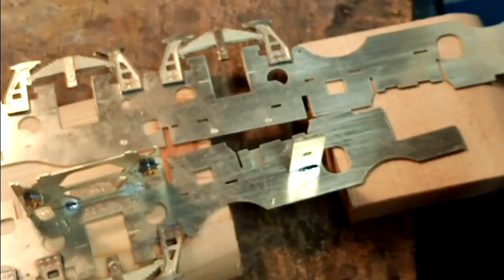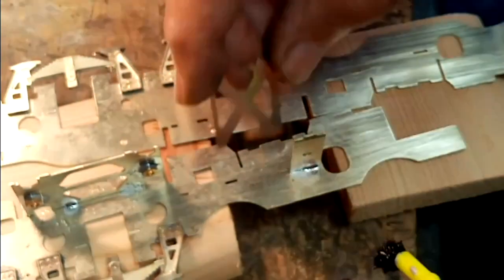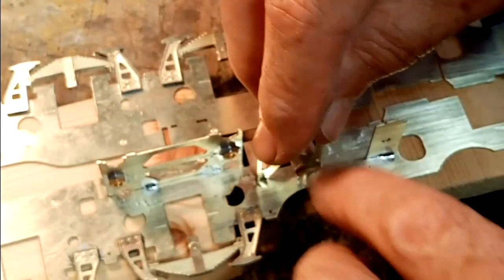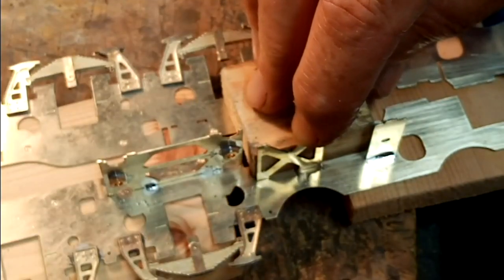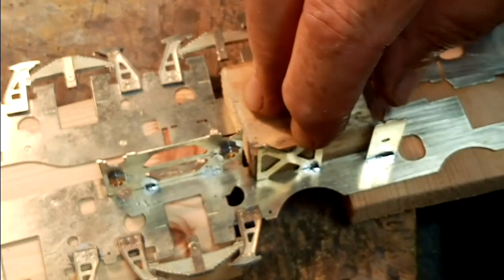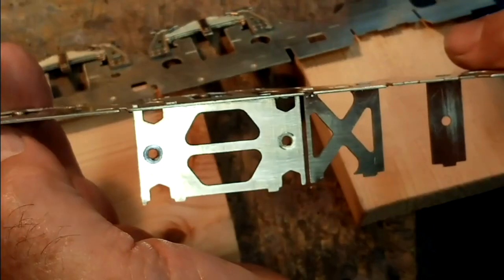which is here. This one doesn't have a forward marking on it, but from the sketch you can see which way around it fits onto the frame, and that one fits in there. So if we pull that over the spacer, over the gap, put my little block in place and hold it square. There we are. So I've now got these three frames roughly soldered into place.